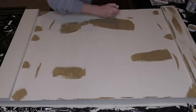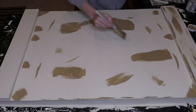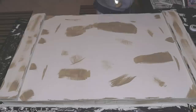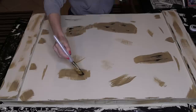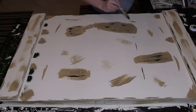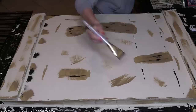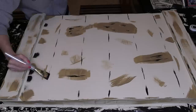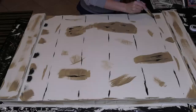I'm going to put the Hazelnut color in different places throughout the top — it's going to look funky for a moment, but when we sand it, it's going to look amazing. Then I go back in with some black as well. You want to soften the edges of areas where you added paint so there are no sharp lines. Some areas on the Cashew I'll sand through to get to the black — that's only two coats to sand through rather than four or six.